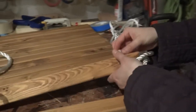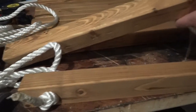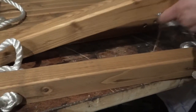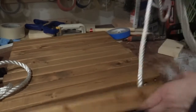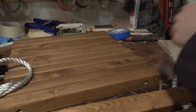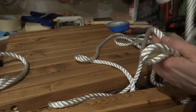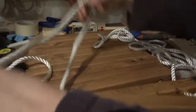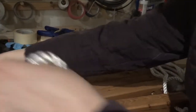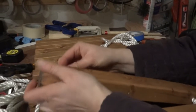Now the first and last piece, just make sure that they're good looking pieces, because they're the only two pieces that the sides are going to be visible. The bottoms of course are not visible and the tops are visible, so when you select your wood and how you place it, we didn't show you our dry fitting, but that's in essence what you need to do. You need to place them so you have the right boards the way you want them to look as the most visible boards.